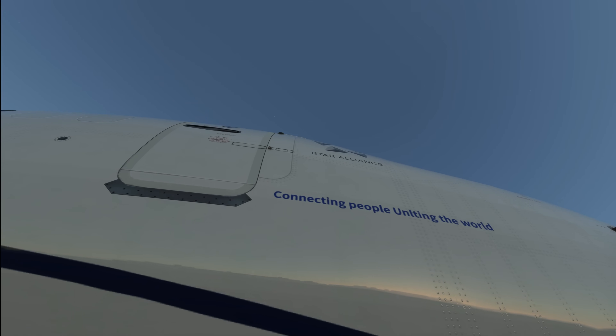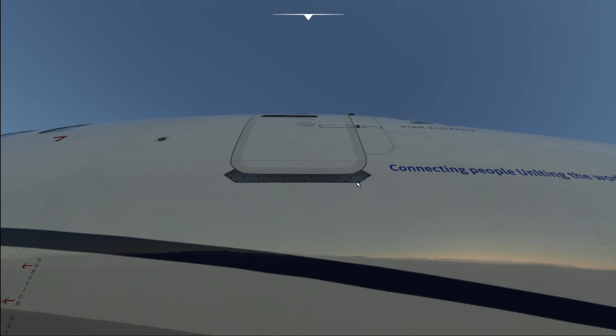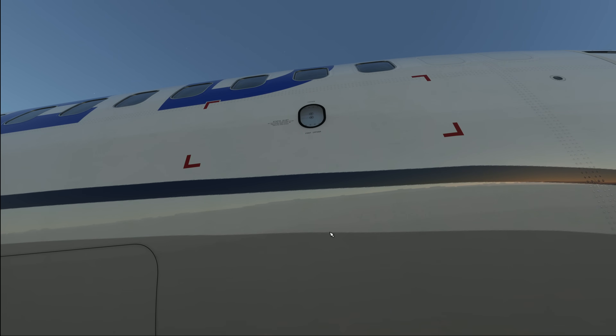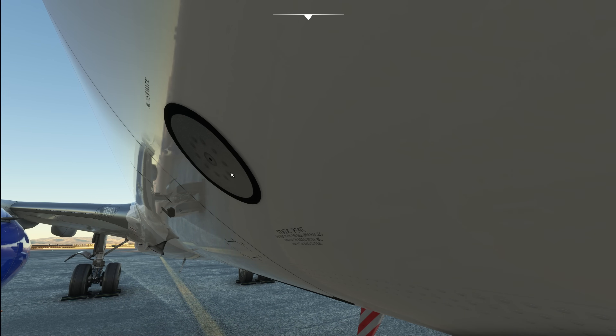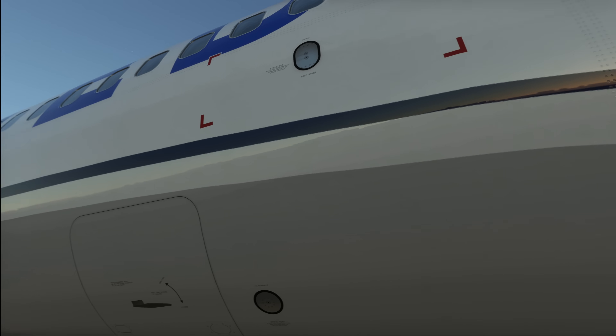As we get across any door, we always make sure that the door handle is flush with the fuselage and that the door itself shows no signs of damage. Moving further along the fuselage, we have our static ports — we make sure nothing is obstructing those ports. Especially if the aircraft has been under maintenance, there might be small stickers on there from washing. If operating under winter conditions, make sure there is no icing nearby, as even the smallest bit of frost near the static ports could cause a significant misreading of the altimeters.